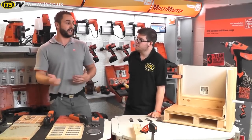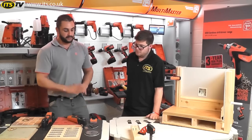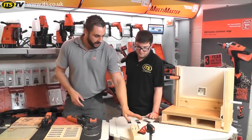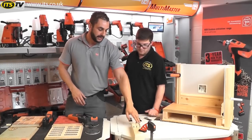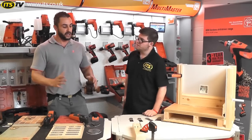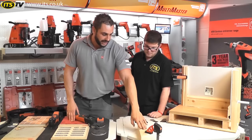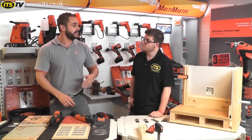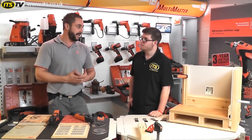When we asked them what they were cutting — metal fixings like nails? Absolutely fine. Even a nail that's a bit bigger — absolutely fine. Copper pipes and stuff like that — fine. But when it comes to something like hardened screws, and a lot of the screws now on the market are hardened, they won't cut them. You'll just find you're going through your blades.